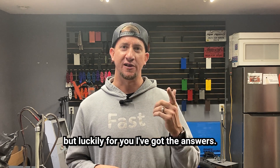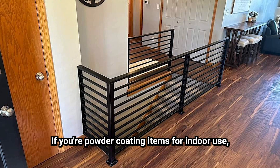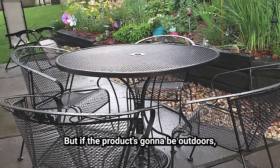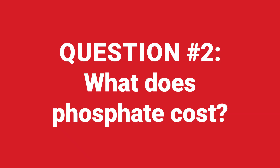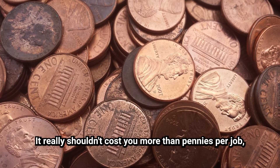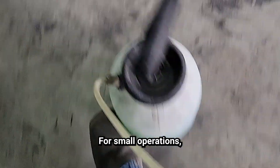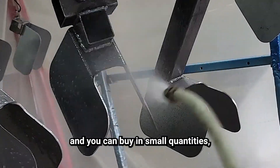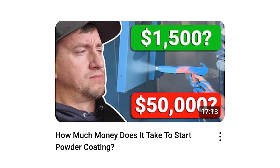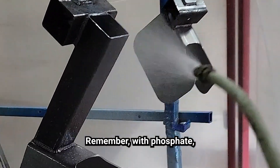Now I know you've got questions — luckily I've got the answers. Question one: do I need to phosphate for every project? Not necessarily. If you're powder coating items for indoor use with minimal wear and tear, you might be able to skip it. But if the product's going to be outdoors, it's a must. Question two: what does phosphate cost? That's going to depend on your chemical supplier and how much you dilute the solution. It really shouldn't cost more than pennies per job and it adds so much more durability and life. For small operations it's very affordable — definitely worth the investment. Feel free to reference our 'how much money does it take to start powder coating' video for more in-depth phosphate costs and options. With phosphate, a little goes a long way.